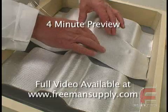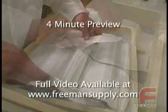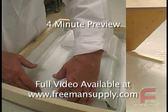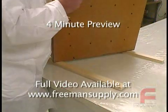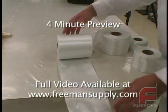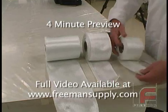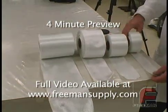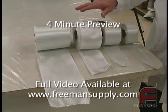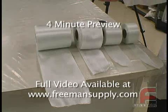Now it is time to cut and fit our pieces of fiberglass. To make the laminating process proceed quickly, we want to pre-fit all of the pieces of our fiberglass before mixing the resin. First, we connected the mold frame temporarily. We are going to use a combination of 6 inch, 4 inch, 3 inch, and 2 inch fiberglass tape. All of these tapes are a 10 ounce fiberglass with a plain weave. Fiberglass tapes are excellent for smaller jobs because they reduce the amount of cutting required and have bound edges to prevent the fabric from unraveling.